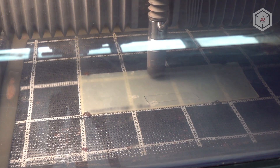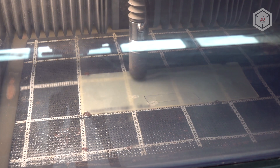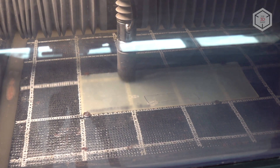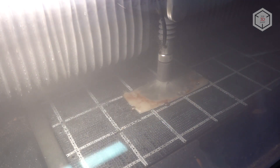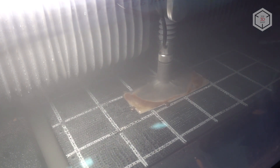Before starting operation, it's important to make sure that the part fits on the workpiece. This can be done with a dry run, where the head passes through the entire trajectory without water injection. In terms of noise level, Wazer can be compared with a car compressor or an electric meat grinder — even a screw gun makes more noise. At the piercing point, 3mm glass is penetrated in 2.5 seconds, 6mm ebonite in 5 seconds, and 2mm 55-60 HRC steel in 15 to 20 seconds.